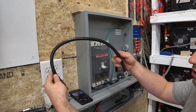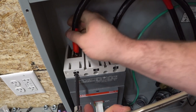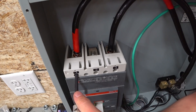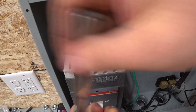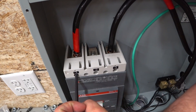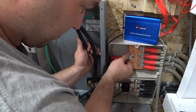But if you know of one, please let me know. Now this is a chunk of 3-aught THHN. It's very stiff — there's not a whole lot of strands in it. So there's a set screw, and I want the set screw to come down in the middle of that. I'll back it off a little bit and re-tighten it.